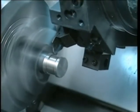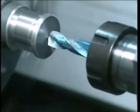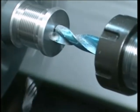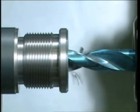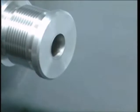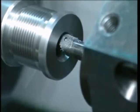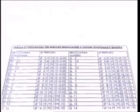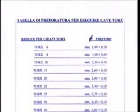Since a 12 mm hex must be produced, before proceeding with the broaching operation, it is necessary to drill a pre-broach hole having a slightly larger diameter of 12.10 mm. Regetti Mechanica provides pre-broach tables for broaching operations designed to obtain square and hexagonal cross sections and sockets for Torx wrenches.